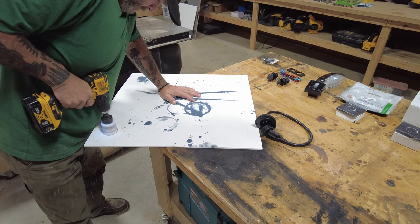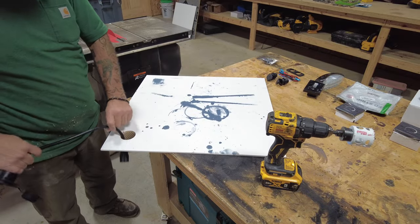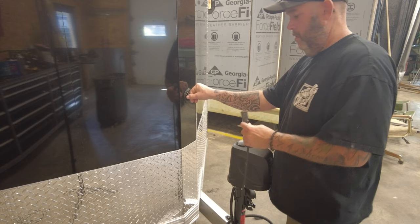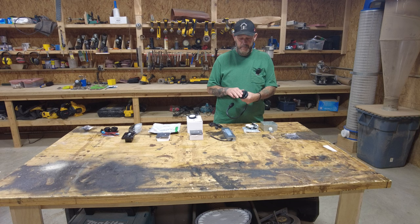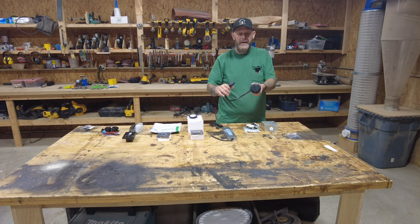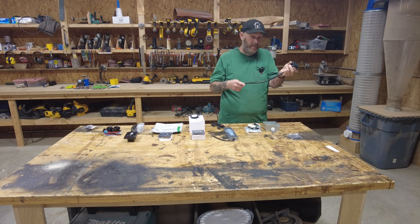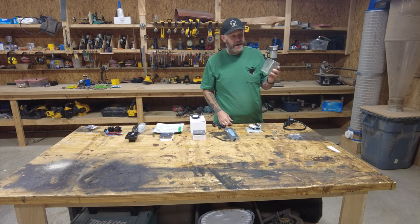On the front of my trailer, on the nose, there's about a six-inch flat spot at the point, so I will mount the shore power inlet there. I got all this stuff on Amazon and I'll put links in the description. You could probably find a bunch of it at your big box store too. This is the part that goes on the outside - this rubber gasket will seal it to the trailer with the provided screws, and it's got a plug to keep it waterproof while driving. I'm going to drill this through the front. On the inside, as the plywood comes to the nose, there's a flat metal channel.